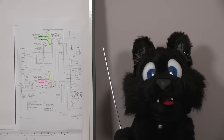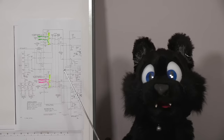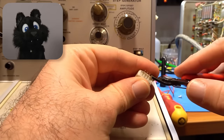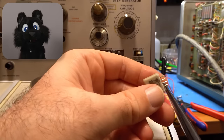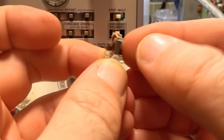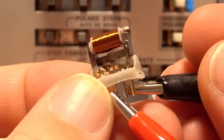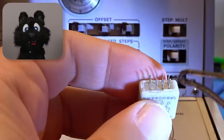Oh, remember those two relays on the display switching board? Turns out that the one for the horizontal signal was not working. When the calibration unit wanted to feed a signal, it would just go into random noise near zero mode. I pulled out the relay, opened up the case and found the actuator to be stuck and seized with some rust. Took quite a bit of careful work to free it up again. Woohoo! It moves! Closing it up again with some heat staking to keep the cover on.